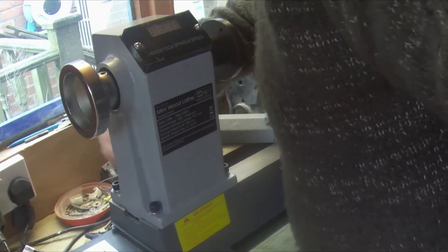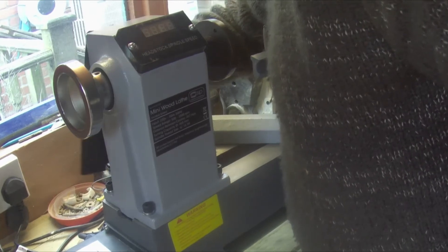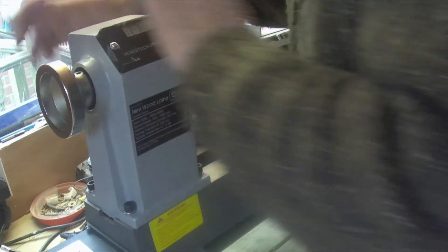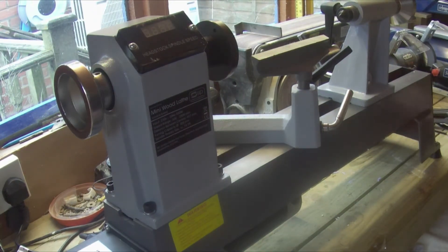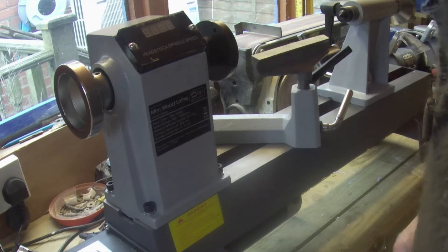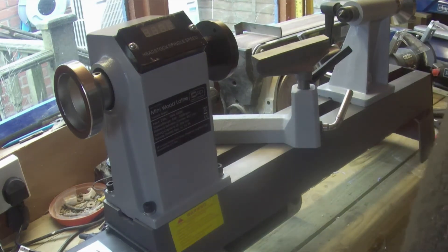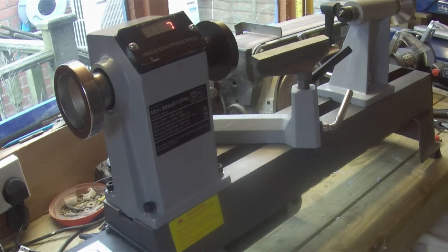Changing the spindle speed — there is a belt rather than a plate. It's actually set on the middle one, so we'll leave it there, which will be fine for what we do. No spanners needed for this, which is good, because you do have to move that to one side to get to the bottom pulley. I thought that would be awkward but no problem at all. I think that actually goes like that. Very quiet, very nice.